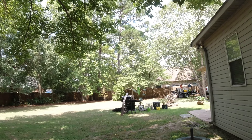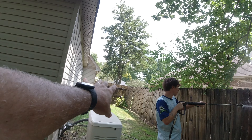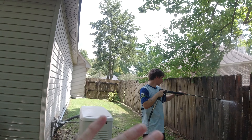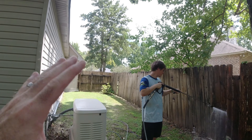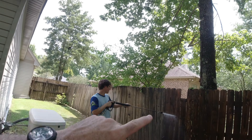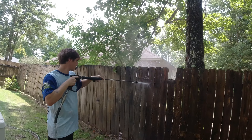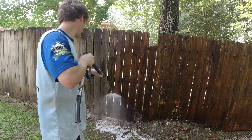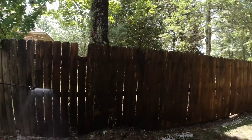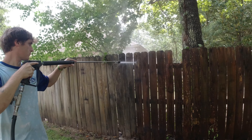We've been here about an hour, a little over. We've got all this fence done. We pre-treated it — wet it really good, hit it with two percent, no soap, just bleach and water. Let it sit for about ten minutes. We've been in rotation, so when Tony's rinsing I'm spraying with water and bleach. You can see here — let's get some live action of Tony. We've been swapping on the gun because it's hot, but we've got a lot of shade so that's nice.